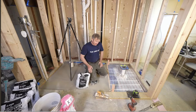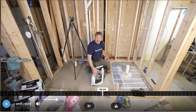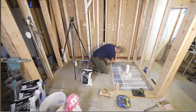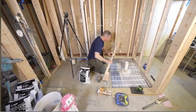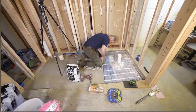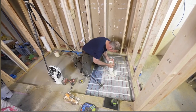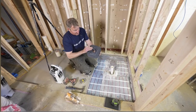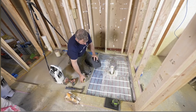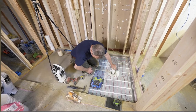You could go ahead and buy Portland cement and sand and mix it yourself, but I really find it's a lot more foolproof and easier to just buy a bag of this pre-mixed product. You're able to add the right amount of water pretty easily and get a nice mixture. First, let's remove our boards. We're going to go ahead and get our drain set — we have about an inch and a quarter exactly where we wanted for the slope to the drain. Let's pull this spare pipe out.